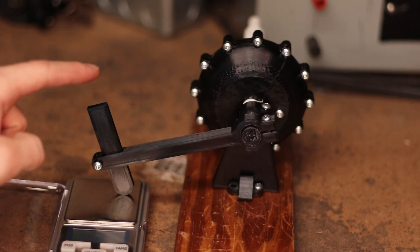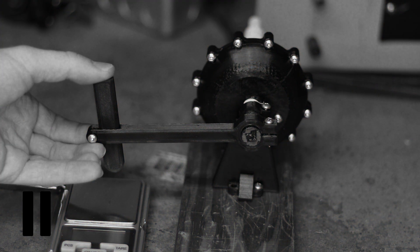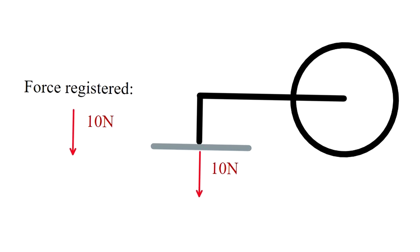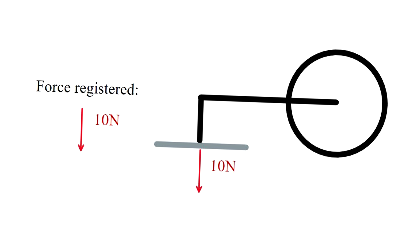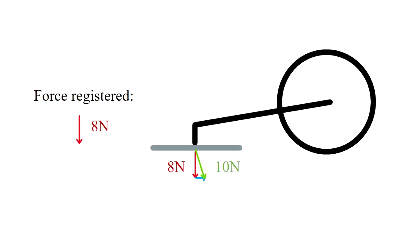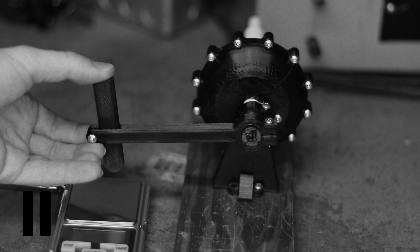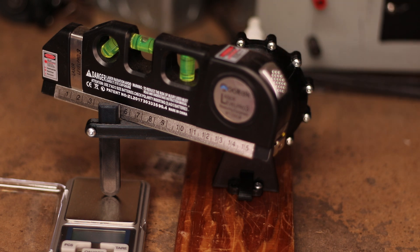The first test I want to do is see how the torque changes as the speed increases. Theoretically, this torque should increase gradually as the speed increases — realistically it should be a graph that levels off at a point. Now I have to adjust the leveler until the beam is horizontal. From this simple drawing you can see that when the arm is perfectly horizontal and pushes down on the scale, it registers all of the force, because the scale can only read force that is up or down. When it's on an angle, the scale reads a smaller amount than what it's really making — that's why it must be perfectly horizontal.